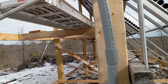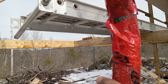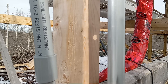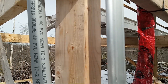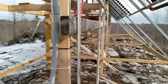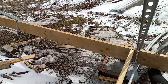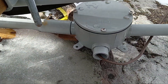So I put the cables inside a conduit and made sure they were covered with a makeshift covering — I didn't want to add another conduit, just used my own solution. I corrected it and made sure the conduits are covered so it's safe for any kids who might come up. I also had to put in electrical-rated T-junctions; you cannot use a normal plumbing pipe there — it has to be electrically rated.